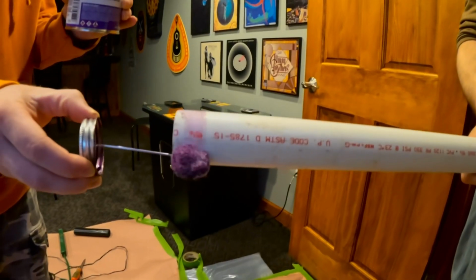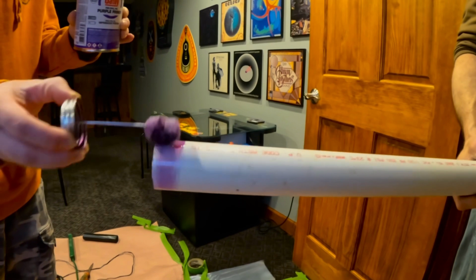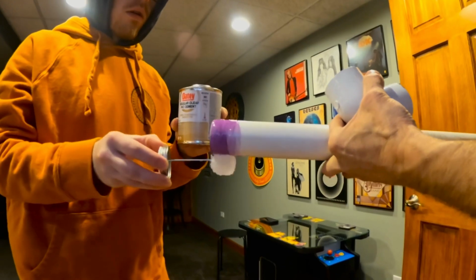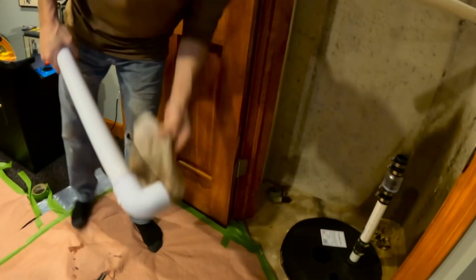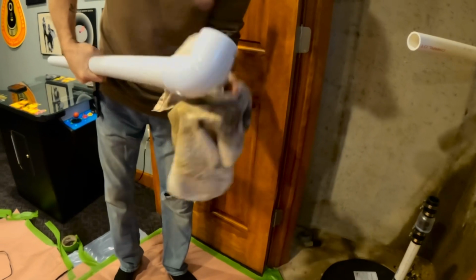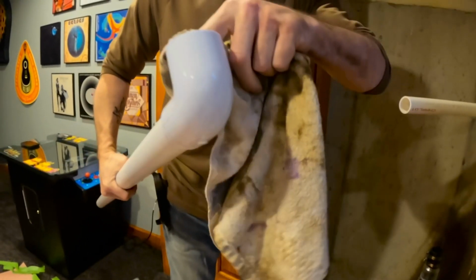All right, primer. Luke, you want to prime me? Oh, no pressure, just wipe it and I'll spin it for you. Go up about 1.5 inches on it. Okay, good. And that's okay. This is why you have a rag ready to go, for that purpose. You never want your glue to run into the next joint, ever.